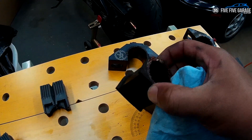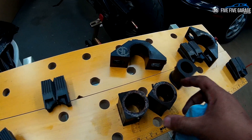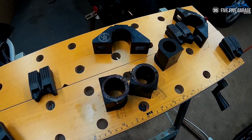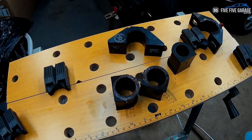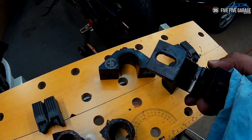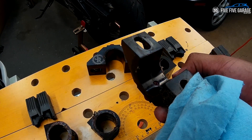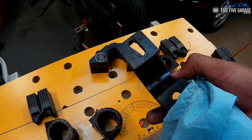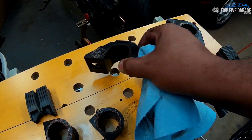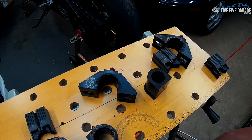So these bushings were under-greased and wore out. You can see in there that there are wear marks from where whatever grease was in there has dried out long ago — and that is probably the cause of the issues I'm having. I'm going to replace these obviously, and I'm also going to put some new grease fittings in these brackets and remove another potential headache, because these fittings look all caked up. So I'm going to get started cleaning those and then pick this back up after I've made those small changes.